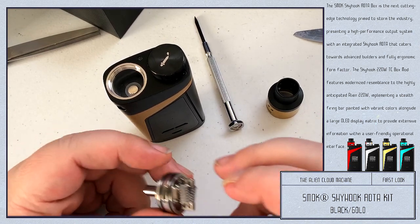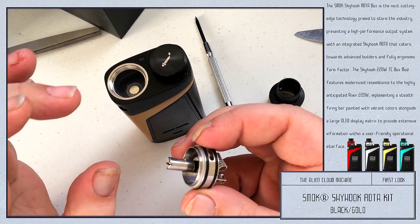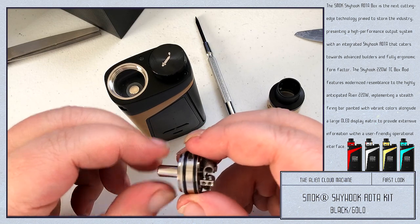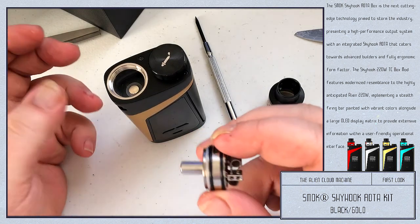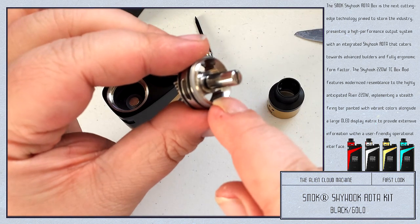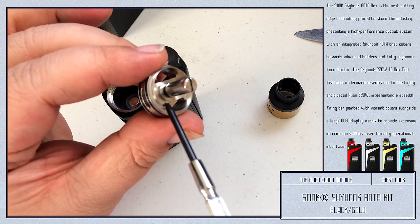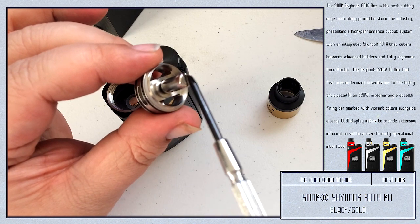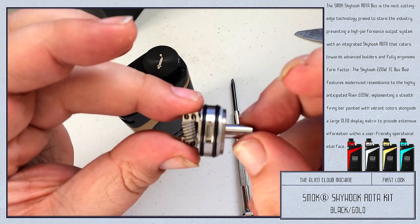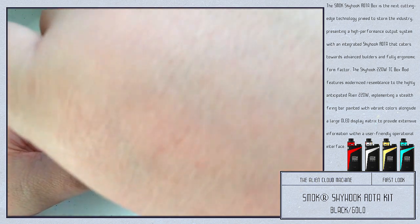I did a little bit of research. This pin right here — for whatever reason it's not going down far enough to have the connection for the coil to register. So I screwed it down quite a bit; it's a little more loose than I think it should be. In order for it to read the coil, I had to do that. At the top of these posts there are a couple of washers — plastic washers, O-rings, or Delrin — and I might try to add something there so I can tighten it back down. Anyway, it is now registering the coil at 0.25 ohms.